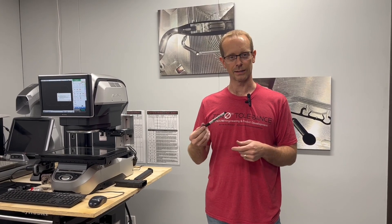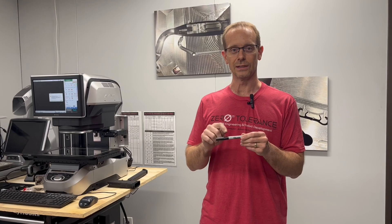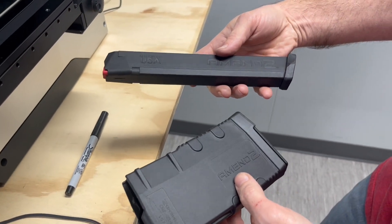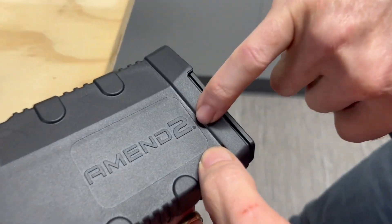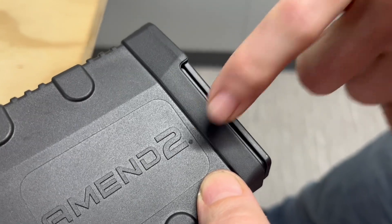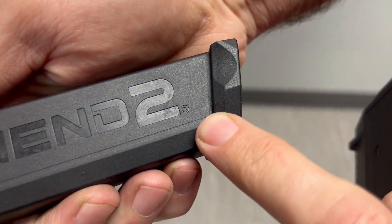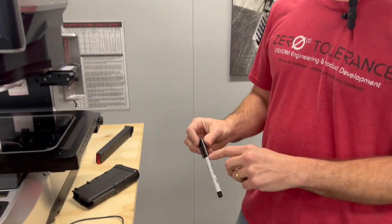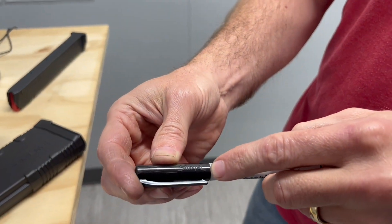I'm going to try to show all the different sizes of these small cutters. Cutting electrodes is not bad, but they do wear out and they don't last very long. We've come across a way to utilize another method of making very detailed electrodes that can achieve this small detail. Here are a couple common parts that are injection molded that have this registered trademark symbol on them. You can see it's right there — it's very tiny. Some of them are embossed in the plastic and some of them are raised. On our Sharpie pens and all kinds of different products, they have this little mark.